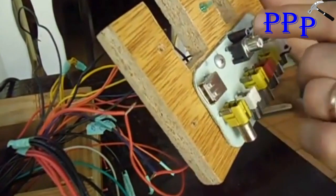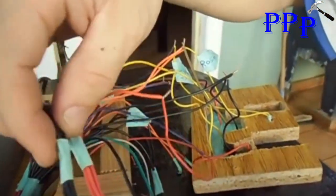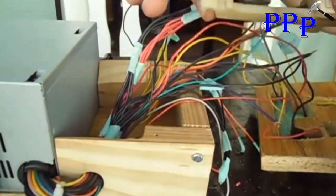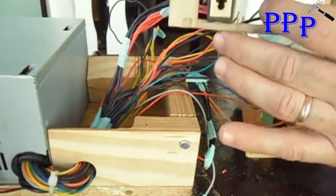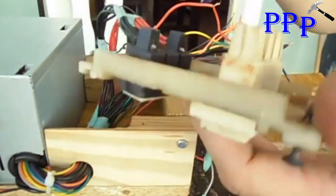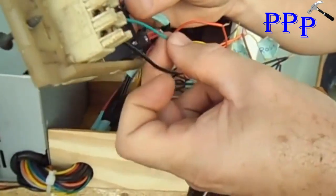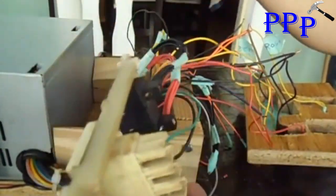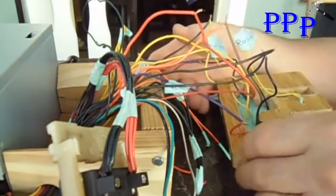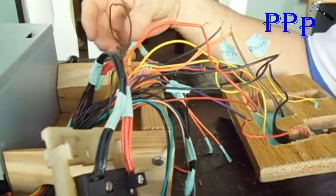Now let me show you how it works. For the remaining wires, I took several black wires — which are negative — and bundled them together. On the socket we'll use for the pyrograph, it draws a bit more amperage and heats up a bit, so I thickened the wire slightly for the 5 volts. On the power button, we connected a negative and the green wire as I showed earlier. Leftover black, yellow, and orange wires — I insulated the ends in case we want to add more outputs later, that's why I didn't eliminate all the wires.